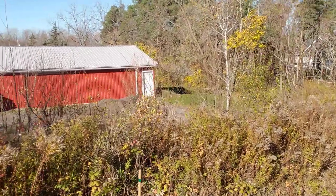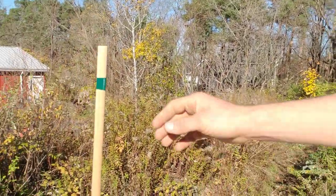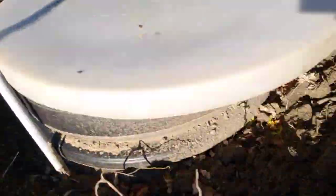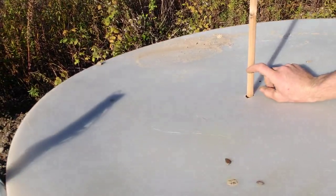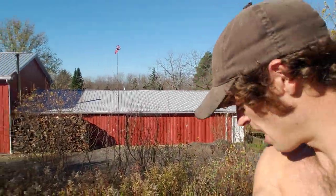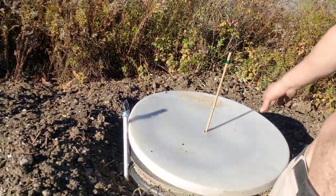This is a cistern well. There's a simple bobber in there to see the water level. I've marked the low water mark, so we don't have a whole ton of water, but I found out it's plenty — we run the system for about 10 minutes and it only drops about two inches. Two main drain tiles that run right through the greenhouse all the way down here are feeding all our water needs right now.